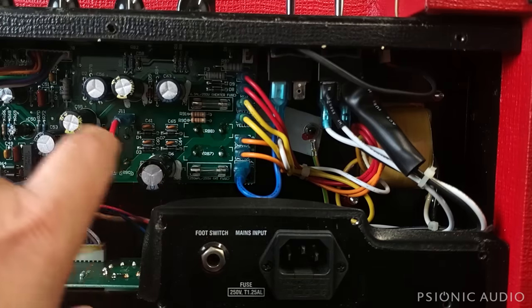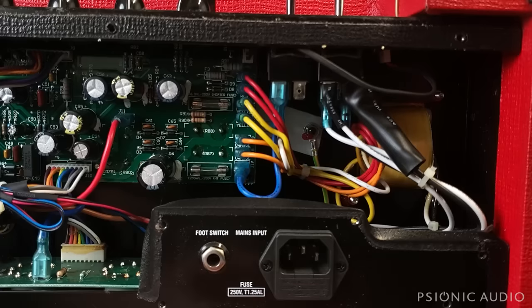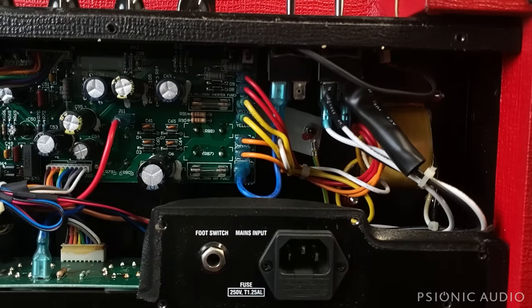They've increased the filter cap's value, which offsets the need for a choke. And as far as a tube rectifier, people are asking a lot, can you add one to this? I could. You wouldn't want to pay the bill. I'd have to change the power transformer because this one does not have a 5-volt winding for said tube rectifier. Neither is really a good way to add one without a lot of expense to the chassis. And it doesn't really need one.